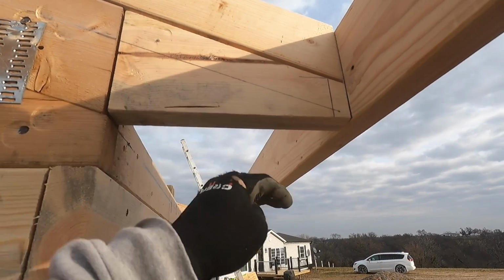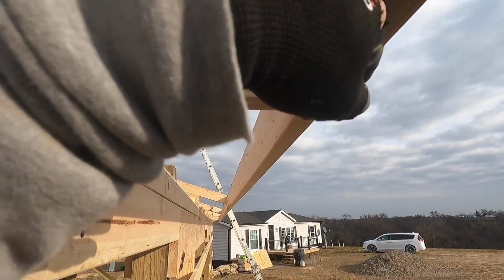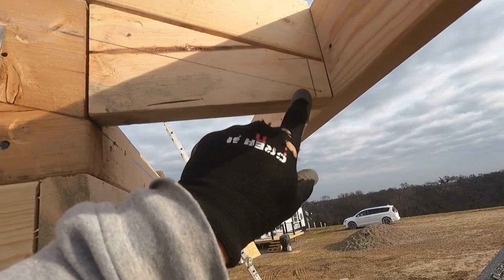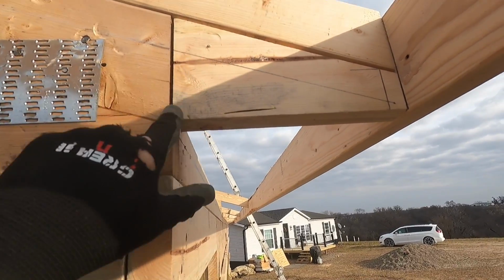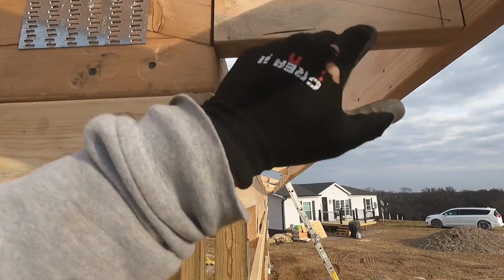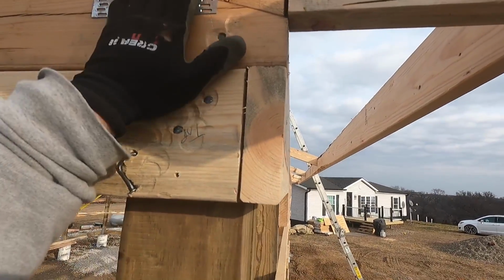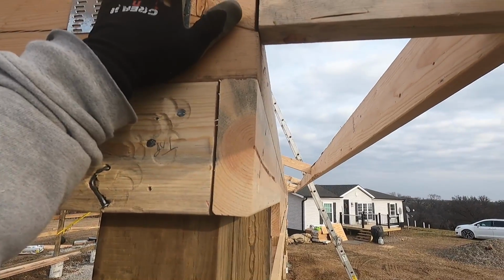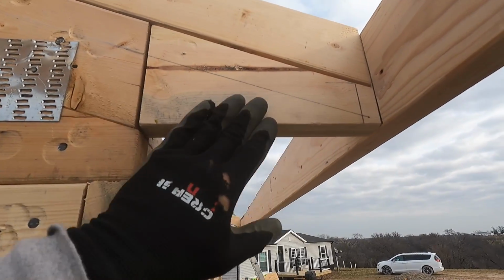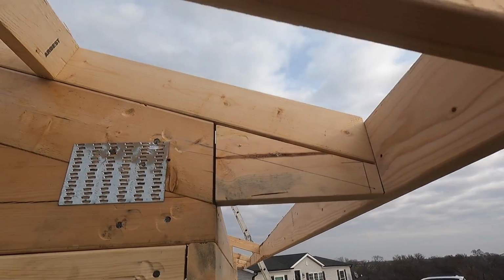get trimmed out. So then my soffit will come along here, stop right here, and then this soffit will go up at an angle. So the only part you will see is this little triangle right here, and then our corner trim will come up and cover everything. But this will be really easy, just to bend a piece of black metal that matches their steel and soffit, and that looks really nice versus bringing this all the way out and squaring it off. I call those bird boxes.